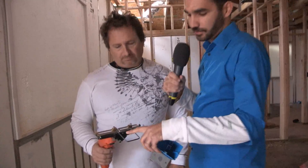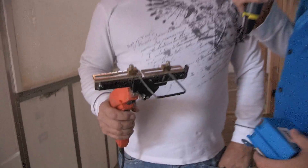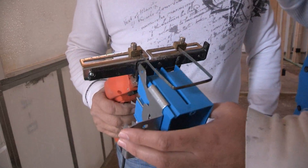What we have here is called a hot knife. It's basically a flat wire that heats up, and what we've done is we've shaped it to be the shape of a single gang box. If we need to do a double gang box, then we'll just do two cuts.